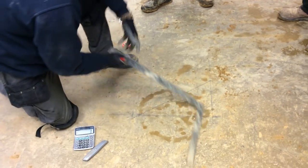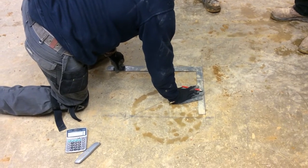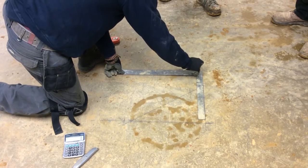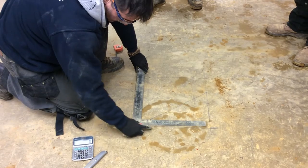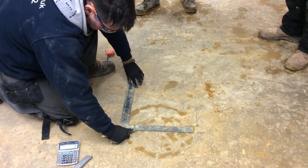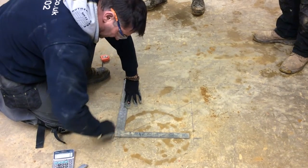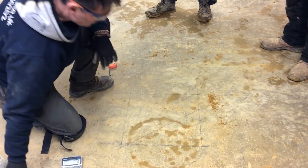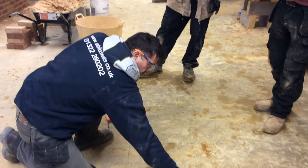Back onto the square and we'll draw that one in again. The last cross-check of anything, whether it's a rectangle or a square, should be your diagonal length. What we should work out is what that diagonal length should be.